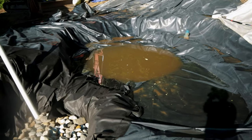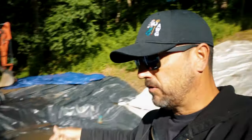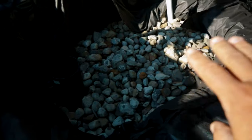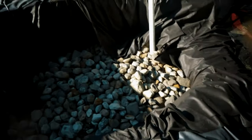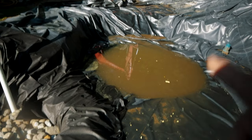It's a good thing we covered everything up last night — that's a foot of water inside the pond. We got a tremendous amount of rain last night, but we took the time to cover as much as we possibly could so our dirt should be fine. Now we can actually start setting some rocks inside the pond and finish up this wetland filter. That's our first layer of those four-to-six-inch cobbles. That pipe is the one that's going to go down to our centipede, feed across, and flow up through the wetland. It's crooked because we're actually going to run our plumbing inside the pond to get over to where our intake is — I want it as far to one side so we can get behind our rock work. This way it's going to be nice and neat. Now we're ready for our other layers of rock and gravel, which will bring us right up to the top.